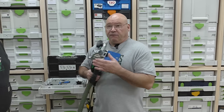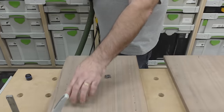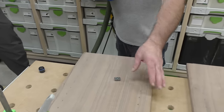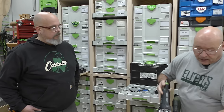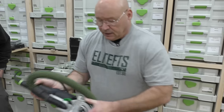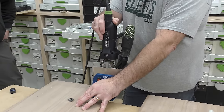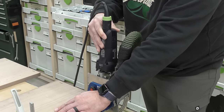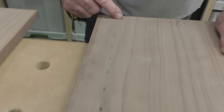We have our domino set at a depth of 15 and we're going to rely on these two flappers. We're going to go from here to here, and each one lines up with these holes. We're not going to work off the back groove and we're only putting two domino connectors — that should be strong enough. The dimension from here to the center is 37 millimeters. Everything is done in the tight position. I went from 37 to punch this, and you can see how that lines up perfectly with the connectors.